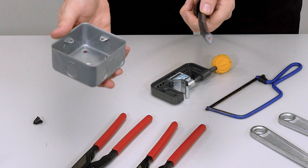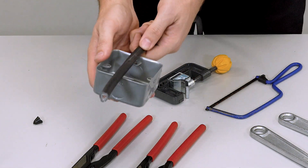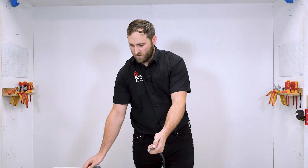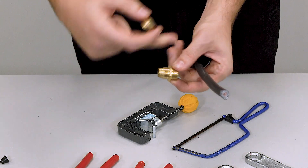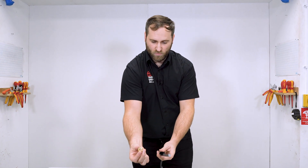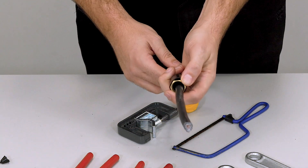The next thing I want to do is measure how much cable I'm going to need for termination. Using my box as an example, if I needed to terminate this much cable, this will be the mark for my first cut. Before I do that, I'm going to put this section into my shroud — that ensures I don't forget to put it on later. I'm going to leave that there and put the back piece of the gland into my shroud so I can see it and use it later.